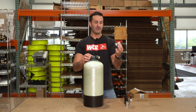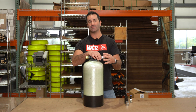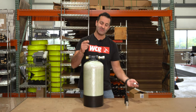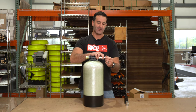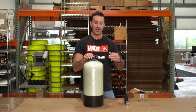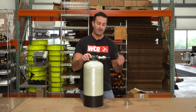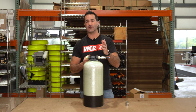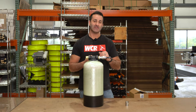This is an upgraded version of the one I just had on here. It actually has a stop built into it. There's no on/off switch built into the actual quick connect, but it does have a stop. So once you remove the male part of the quick connect, there is a ball in here that will sense the pressure and stop the flow of water — so you're not going to have water squirting out. Nice, simple, inexpensive upgrade from plastic to metal. This isn't something that's going to break, crack, or fall off easily whatsoever, and this one does have a nice built-in stop.